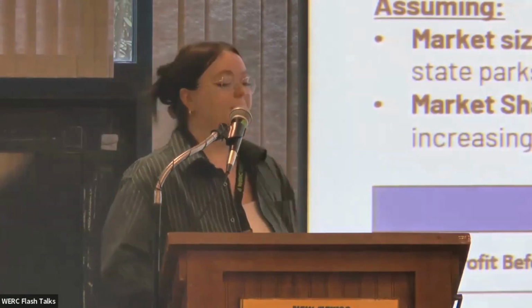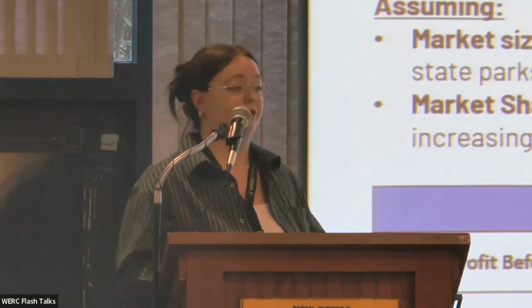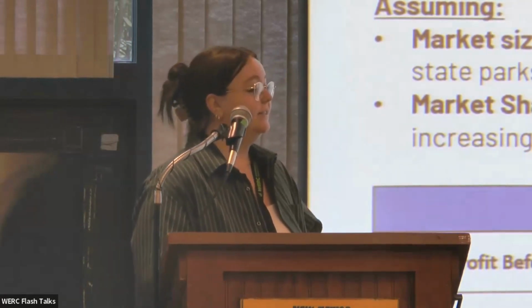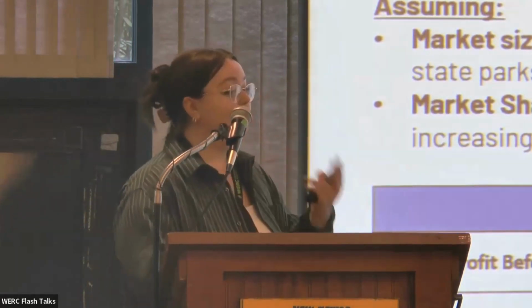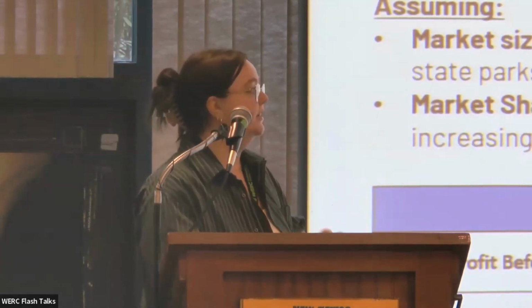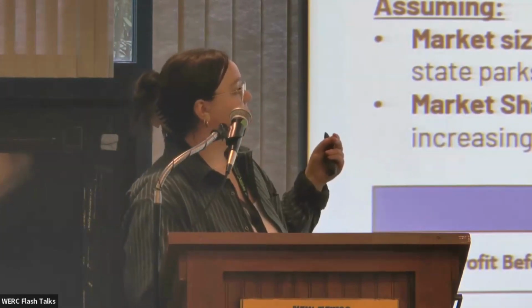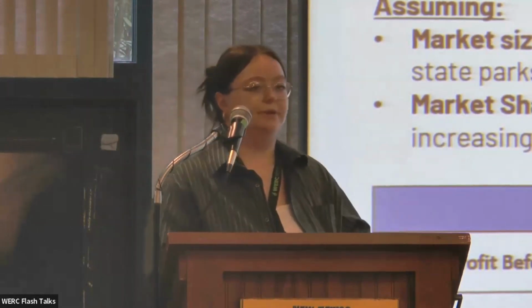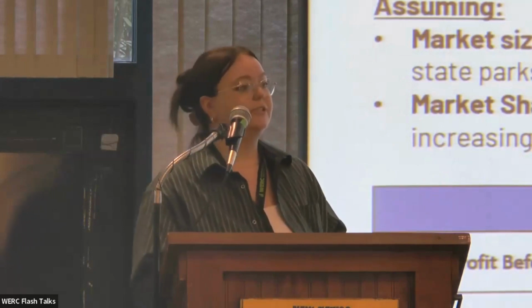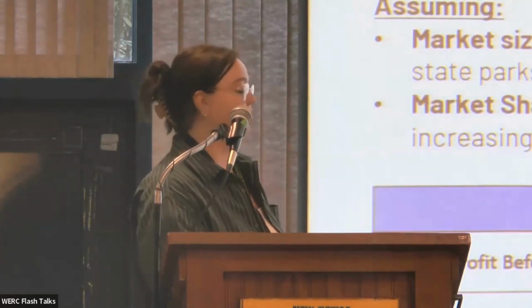So our overall cost of manufacturing may seem expensive at $4,130, but this is necessary because of 2 main things. One is that everything should be metal or stainless steel, because most other materials will stick to the microplastics. And then the other reason being, we're using a syringe pump, which is expensive, but it makes the error in our results very, very minimal.